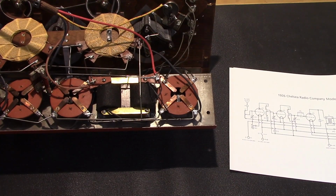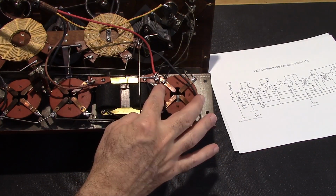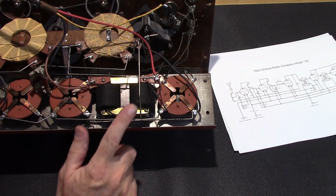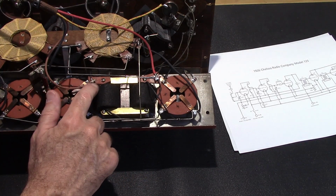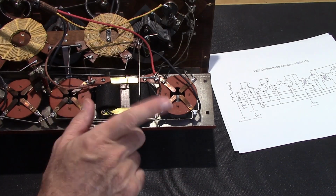Okay, so I finally figured out what my problem is, and it's not good news. Unfortunately, what I did was I wired my transformers backwards. My primaries are hooked where the secondaries should be, the secondaries are hooked where the primaries should be. So I have to pull all the wiring out for the transformers and rewire them properly. So that's going to take me a while, but you don't have to deal with it. I'm going to just go ahead and do it, and I'll come right back.